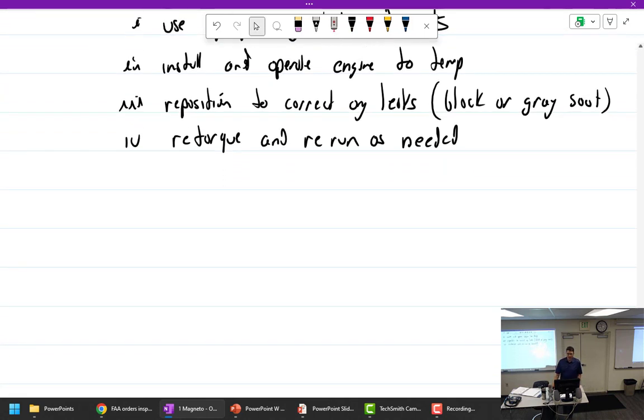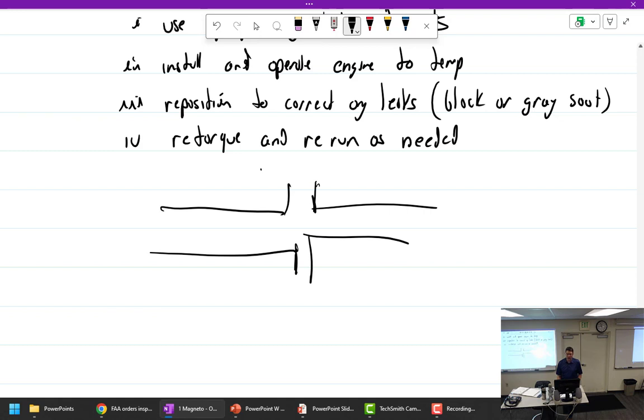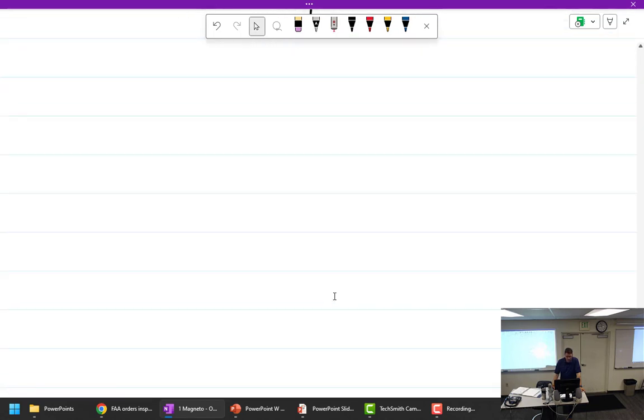I don't have this in my notes, but a lot of exhaust couplings have flanges, and you bolt them up with springs. So you'll have a bolt that goes through, and springs, and then a nut. You have to measure the compression of the springs so it's allowed to expand and contract. Oh, that's why. Yeah. I don't know if it's like a car. I've looked at my car, it didn't have that kind of stuff. The Corolla does, on the cat especially.